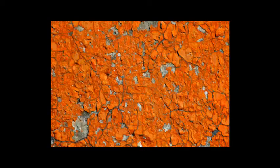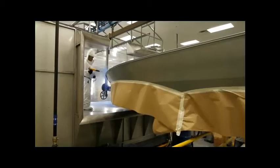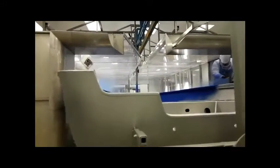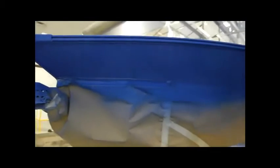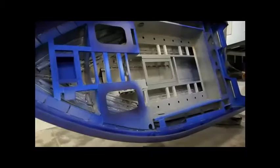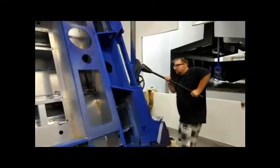There's an alternative, and it's one we usually see with wakeboard towers or side rails on premium boats. It's called powder coating, and powder coating is exactly as the name implies. Dry paint powder is sprayed onto the metal and then melted on for an even covering that lasts longer and is much more durable. But powder coating a whole boat? You bet. Let's take a look at how it's done at Tracker.